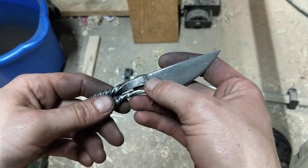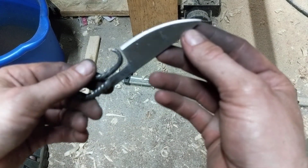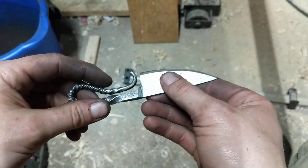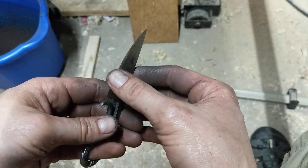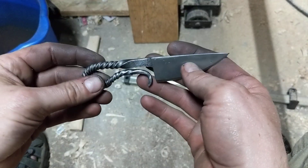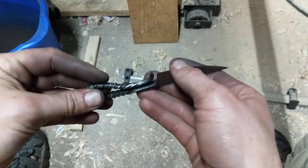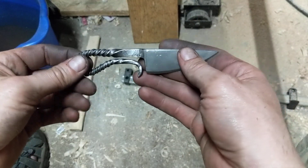It's really the same exact practice as folks who do canister Damascus steel — like Green Beetle, a popular YouTuber who does a lot of canister Damascus. Same concept, except the major difference is we have steel and charcoal instead of steel and steel powder. When it came to opening the can, piece of cake — popped it open and took these out, and I saw all the blisters that you guys saw in the YouTube short. That's how we did it.